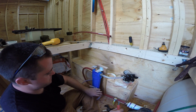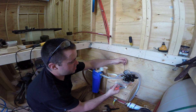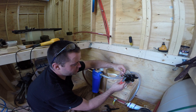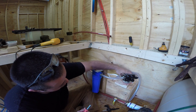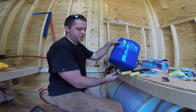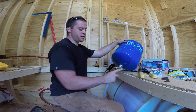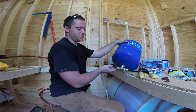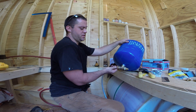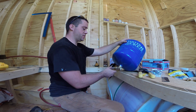This is pretty cool so far. I still need to wire this in — this red wire needs to have a 15 amp breaker on it. On my accumulator tank, I had originally installed a three-quarter inch fitting on one end, but it needs to be half-inch coming in and three-quarters coming out. Now I can fasten the flexible pipe to this side and PEX to the other side.